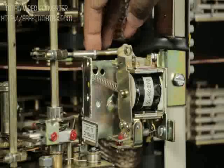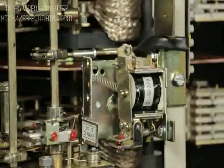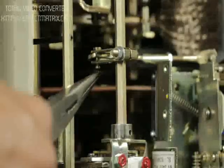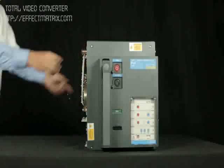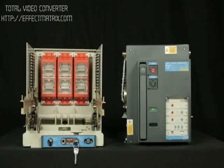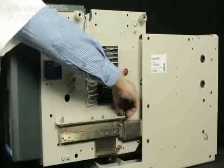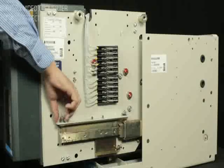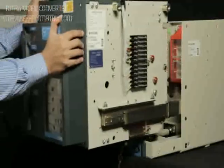Tighten the check nut on the connecting link with a spanner as shown. Insert the circlip to one end of the pin. Lift the breaker straight to its position. Place the breaker over the cradle rail with the mounting slot of the breaker matching with the pins of the cradle. Place the spring washers and nuts, and tighten the nuts on both telescopic rails. Push the breaker to the isolated position.